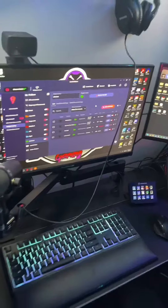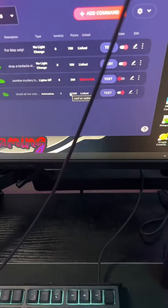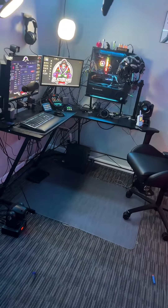So we'll sum it all up: channel point here sends a signal here, sends a signal there, that IR signal opens that relay, starts this spinning, that relay opens after a few more seconds and then it starts to fire. And it yeets. And that's just one of the things I have controlled that way.